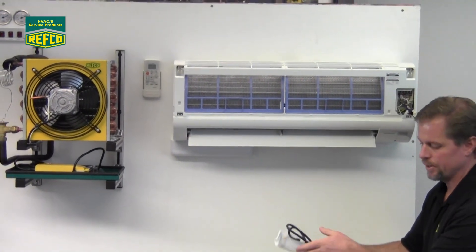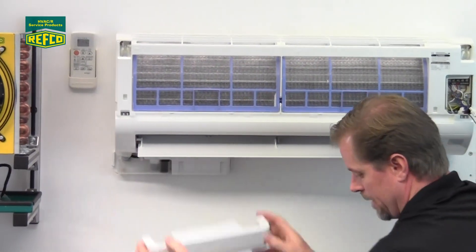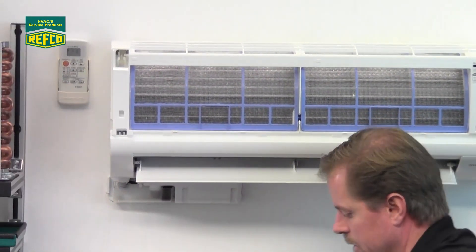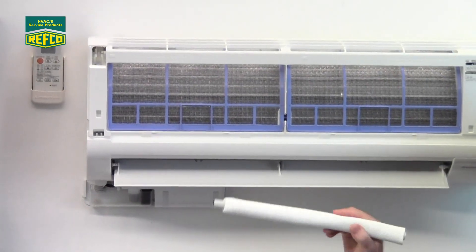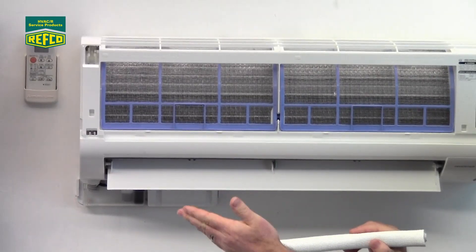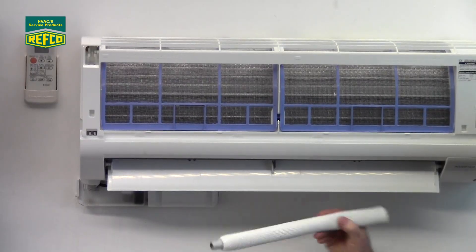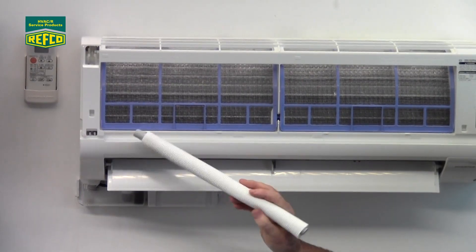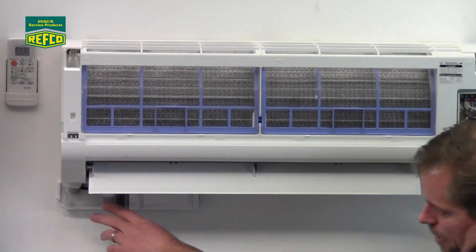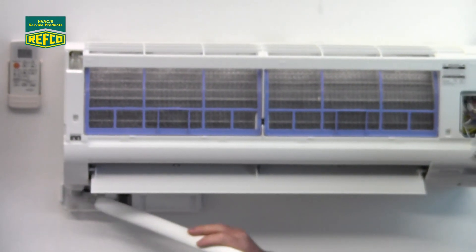Let's take a closer look at this one over here and how it's installed. I'm going to go ahead and remove that cover plate. Now, the condensate drain coming out of your fan coil — the back of the fan coil typically has something that looks like this. Depending on if you want your line set on the left or the right, you're going to have to mount the water drain on the fan coil on the respective side on top of the drain. These pipes are going to be cut off and drained right into your water drain pad on your pump.